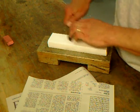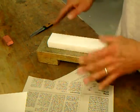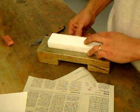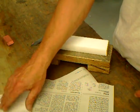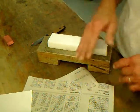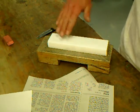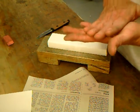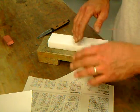The other thing you have to watch out for: if you're burnishing the edge as a maintenance step, you can only do that a couple of times before you have to go back to the compound. As you burnish, it's like a light version of steeling an edge — there's a lot less danger of causing damage, and it's more tolerant of slight variations in angle and certainly more tolerant of pressure. But the end result is the same, and over time you will start to cause some damage to the edge if you don't go back and use an abrasive to pull some of that metal off the apex, then burnish again. You can also go straight to the paper and burnish an edge off 600-grit or even 320-grit sandpaper — you're still going to get some burnishing effect. At the lower grits, it's not as pronounced, but with 600-grit it certainly can, and anything finer does a very nice job.